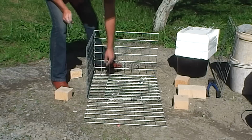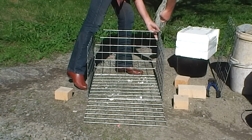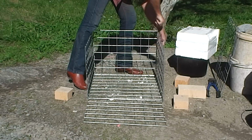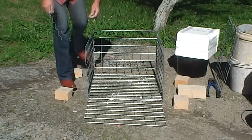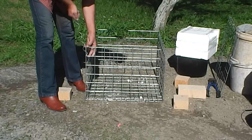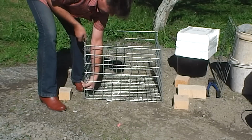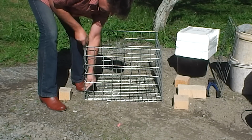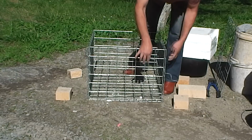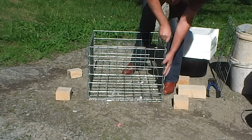This gabion planter that we're building today is 24 inch or 600 by 18 inch or 450, but we have hundreds of sizes available. So this is just a nice easy size to work with. We're using the 4.5mm welded mesh, or if you're an Imperial, the 3/16 welded mesh. And the last helical is just about to go in. Now the cages are just a little bit loose while we're assembling them, but that's normal. As soon as the rocks go in, it'll all tighten up.